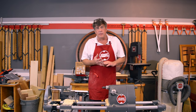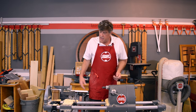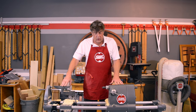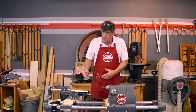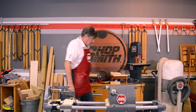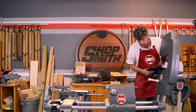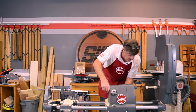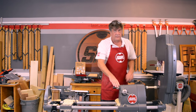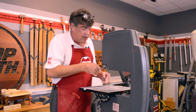To recap: we started with a table saw, the sander, a couple of drills — the horizontal boring — the routing, the shaping, and finally the wood lathe. That's the seven-tool system. But as your woodworking capacities expand, you can add additional equipment: an edge joiner, a bandsaw. All of our optional attachments fit right on the end of the machine and power off the main unit. There's the strongest 11-inch bandsaw on the market today — the ShopSmith bandsaw has an 11-inch throat and a 6-inch depth of cut, so we can do resawing, cutting thick boards to thin.